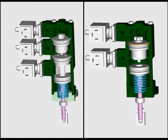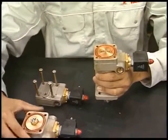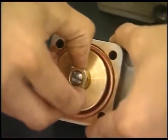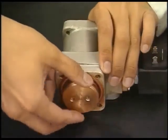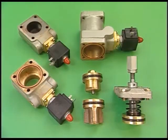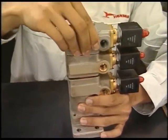I'll explain how to do it. Firstly, remove the air piston assembly from the engine. Secondly, remove the fuel limiting air piston and the piston for stop from the body in order. Renew the O-rings fitted in each piston side surface. After greasing on the pistons, reassemble them in inverse order for disassembly.